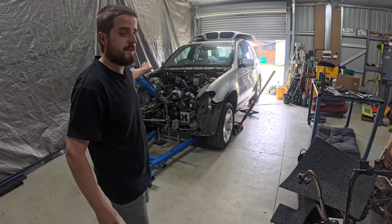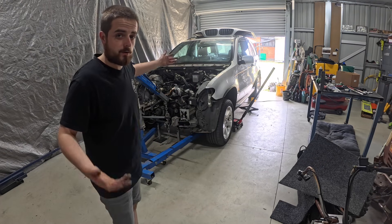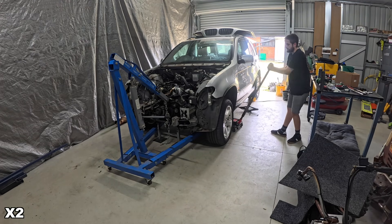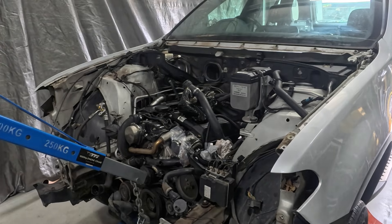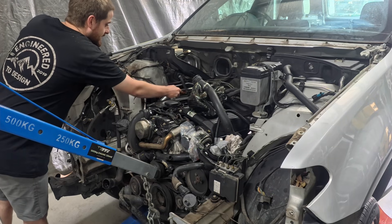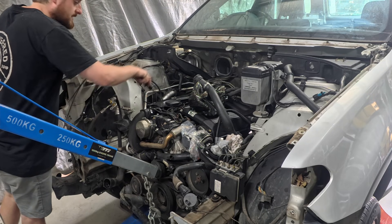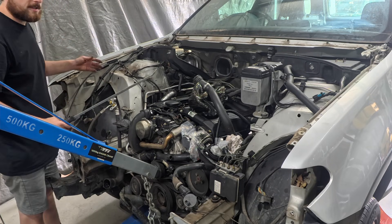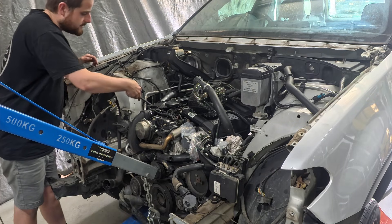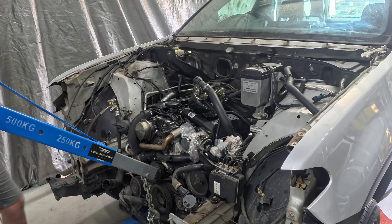I'm not sure how this is going to work. Ideally I would have had the engine crane in the center, jacked it up that way and then had the motor slide out, but it just wasn't going to work with the amount of space. There's always one hose that's been left under tension and forgotten about. For anyone watching this and scared about pulling this out - I haven't done an engine removal in years and this has got to be one of the easiest cars ever. Everything's just so modular, it just comes out of place. The engine only disconnects the engine wiring - it's just two plugs into the ECU. That's it. Unreal how easy this thing is.